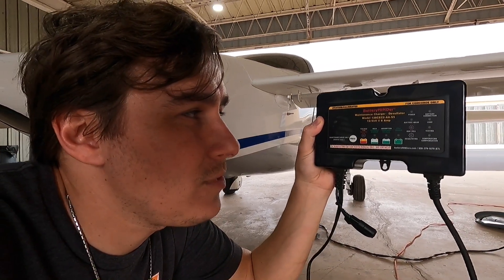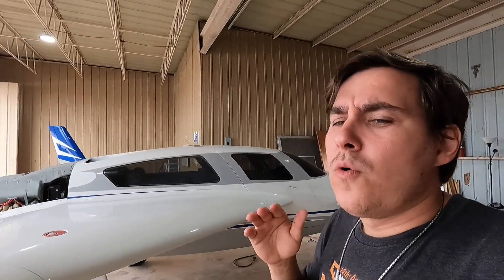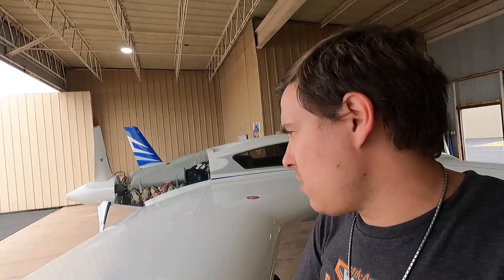These Concord chargers are great for topping a battery off or plugging it in when it's in the hangar, but they don't really charge the battery very well if it's below a certain level - you'll still need a legitimate battery charger. So I put a legitimate battery charger on it after speaking to a tech rep at Emag. He told me that if the voltage drops too low while cranking on the starter, it will put the mags into their safe mode and they won't fire.